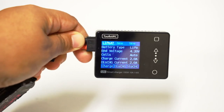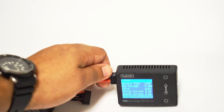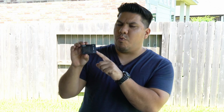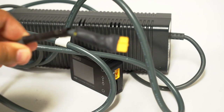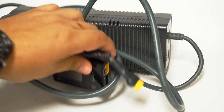One thing to keep in mind — and you may have guessed by how small it is — is that this charger does not have its own power supply, so you will need to provide one. This charger is extremely portable, but your power supply may not be. This thing is a great price at only $25, but your power supply is likely going to cost much more. I built mine out of an old Xbox 360 power brick with an XT60 connector on the end. You can buy various power supplies; they're usually $40 to $60.